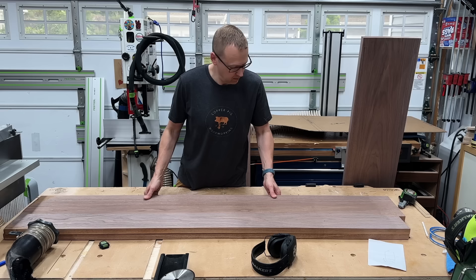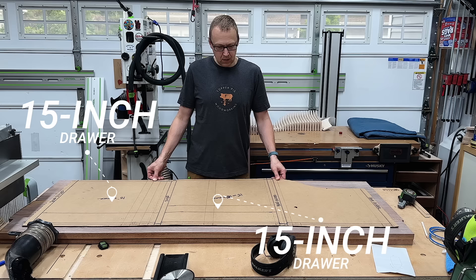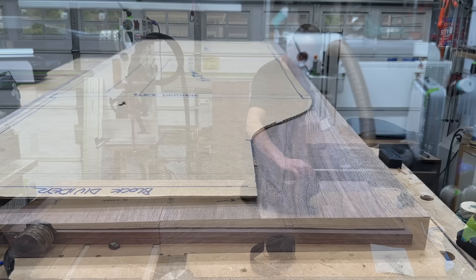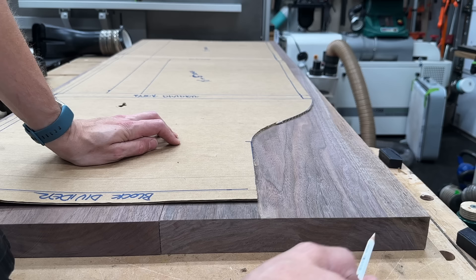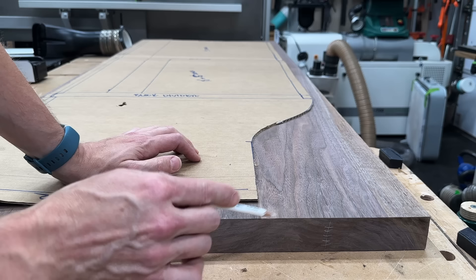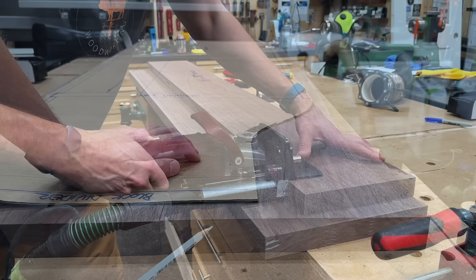These pieces of 4-quarter were a little less than stellar for grain appearance, so luckily I had four faces to decide my show face. Once settled on that, I started laying everything out using this cardboard template showing where all my drawers go - two 15-inchers, where my dividers are, where the cat door goes, and where the curve is going to be in the front. Since this desk curves, the flat-sawn center should give us a quarter-sawn effect along the edge, and after talking myself into that theory, I prepped these boards for glue-up.